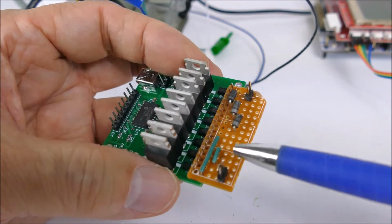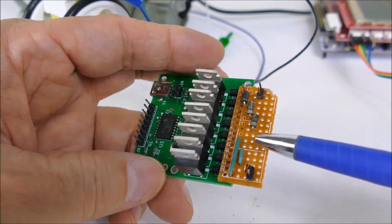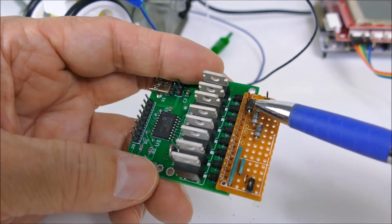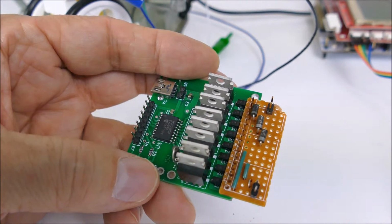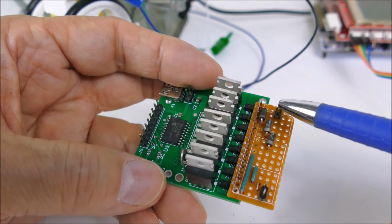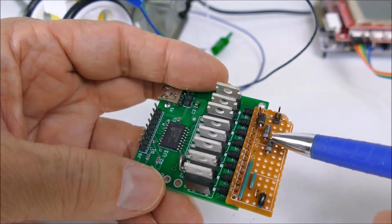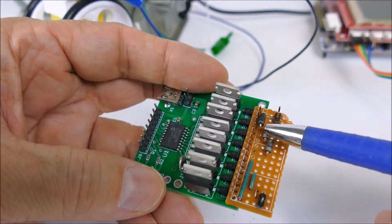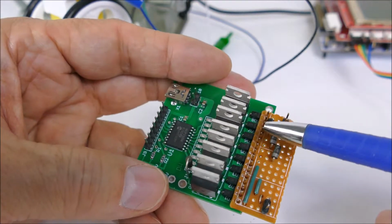So I had to put a little card on the output here to add in these diodes which control the speed of the main drive motor. As we switch between the various FETs, more and more diodes are used, or fewer and fewer diodes are in series with the power.